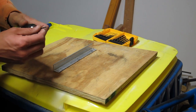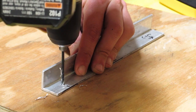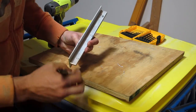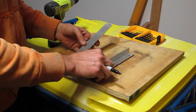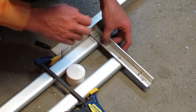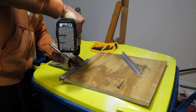I had a template piece and used this leg to mark the holes of the remaining pivoting legs and the boom pieces. Starting with a smaller drill bit helps with accuracy, and since I'm using this as a template, that smaller hole allows me to transfer more accurate marks to the remaining legs. I do this by butting the angle legs up in the right position and using a Sharpie to mark through the holes I drilled. I take the template back over to the boom and mark the holes on each boom piece, repeating this for the other side. I then drill out the holes to the full quarter-inch size using a cordless drill.